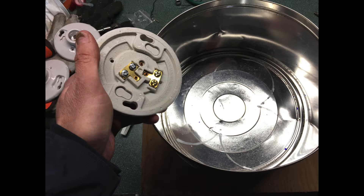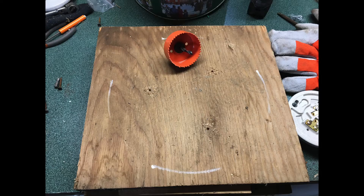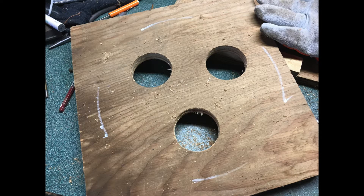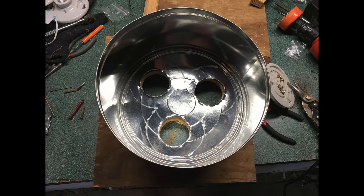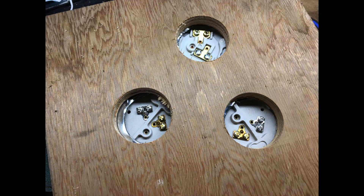You can see I've marked where the three porcelain light bulb holders will be and where the connections are. I need to take a hole saw of the right size to drill out the center where the bulb is so I can connect my wires, but I still need wood there to support the porcelain holder. I pilot-drilled some holes through everything, used the hole saw on the wood and then the tin separately, and then aligned them until the holes line up. We end up with three large holes. We put the porcelain bases down, maneuvering them so the connections are toward the center of the hole — there's a little offset between the can and the wood, and obviously with electricity you don't want to short anything out.